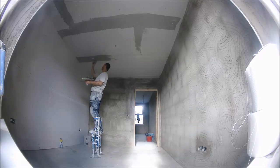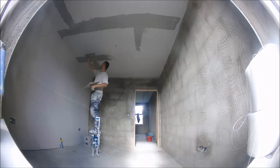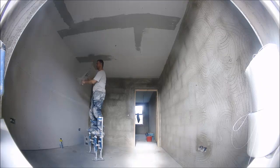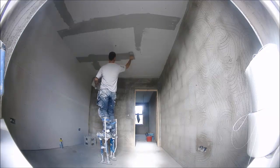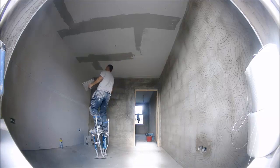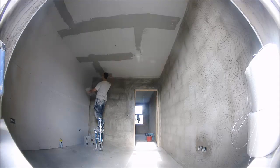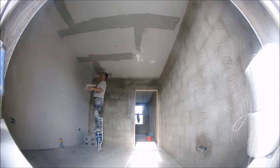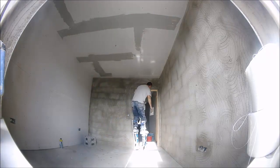Make sure all the screws or nails are in flush and make sure all the boards are tight with no bouncing or springing. Then you would scrim tape all the joints including the corners, and what I do — as you can see in the video — is cover all the joints, especially if they have a beveled edge on the boards which is for dry lining. I like to fill them out and cover all my scrims, especially if you're only skimming the ceiling, so I give all the joints a quick coat.